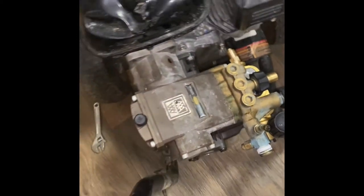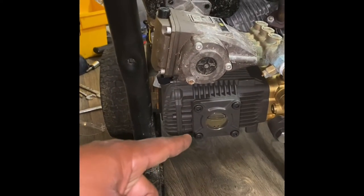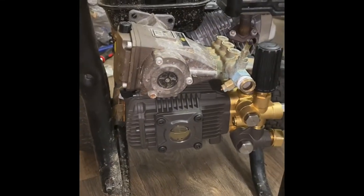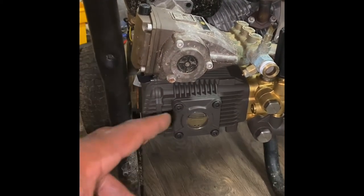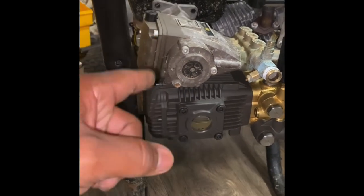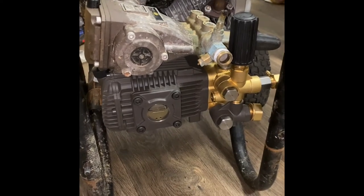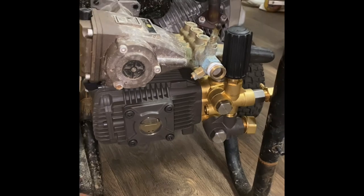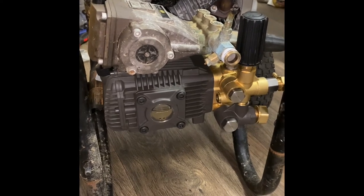There's definitely a significant difference in the size of the pump and I'm definitely excited about it. This is the original pump, and this is the new pump — definitely a major size difference. The new one is a three-gallon-a-minute pump; the old one is a two-and-a-half-gallon-a-minute pump. I really wasn't expecting a huge difference in performance — I just wanted a little bit better flow, a more reliable pump, and a new pump, because I bought this machine used, so there's no telling what this pump has been through. But now looking at the differences, the fact that this thing comes with a separate unloader — I can pull it off and put a different one on, or run a hose away from it back to a tank if I ever get one to keep the pump circulating.